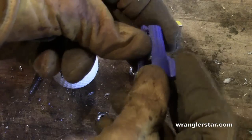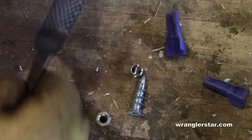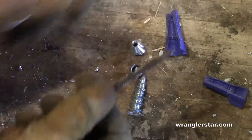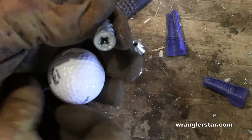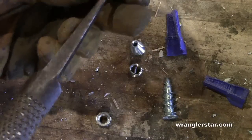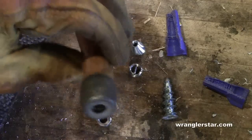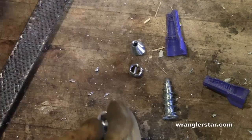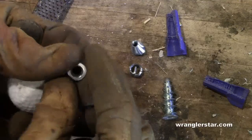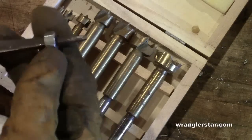I found a big wire nut, cut it open, and thought we could drill a hole and press that in — as you screw the rat tail in, it expands the threads pushing on the outside of the golf ball. I also found some drywall anchors, cut one down with a hacksaw, and drilled it out with a step drill. Then looking at traditional handles, I thought: what about using a Forstner bit to press in a threaded nut for extra strength?